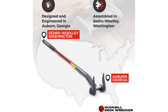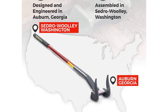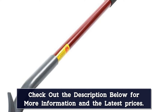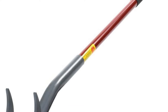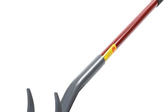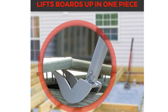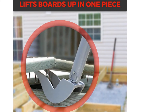The teeth look like they might damage your boards, but they don't. Still, the boards can crack or split during removal, even though the rotating head lets you get in close and get a solid hold on each board. Fewer boards will break if you remove some of the nails first, but this pallet breaker doesn't include a nail removal tool. Another drawback is that this tool has a pretty narrow spread of about 3 inches at the forks, which is fine for fitting over smaller boards used in standard-size pallets, but if you want to remove deck boards off a 4x4 or disassemble an oversized pallet, you'll probably need a tool with a wider set of forks.